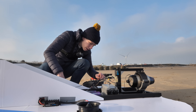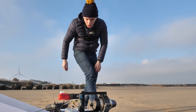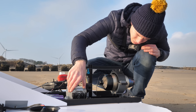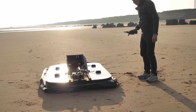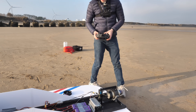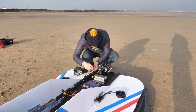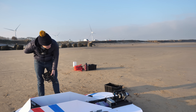So what's wrong with it James? Not quite sure — it just didn't seem to be feeding all of the fuel in. For some strange reason, although it had worked flawlessly on a static run just the day before, the jet engine was refusing to start, which was rather confusing. Time to do some problem solving. I tried changing the battery which powers the spark plugs inside the engine, but it didn't work. Then we thought it could be a fuel flow issue with the filters, so we tried changing these, but still the engine kept cutting out around 5,000 RPM below idle speed.